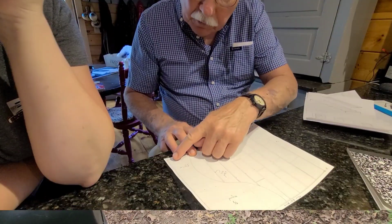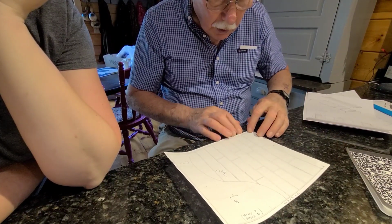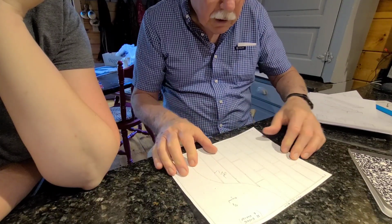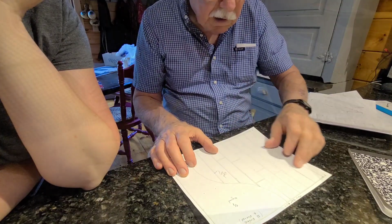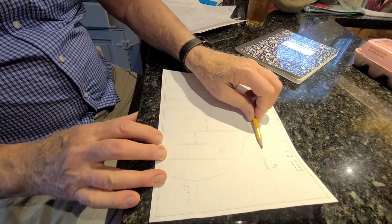That's a 1/2 inch to the foot, so it's a good scale. So you buy your 20 footer. Here's another 20 footer. The rest of them are 2 by 10, 16. Get this squared up. Then you come along and you lay your sheets of plywood on there.